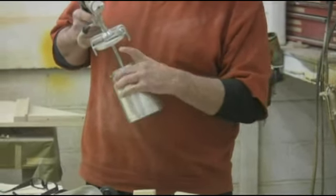I've got a quarter inch peg going into a quarter inch hole. So what you want to do is take that peg and, just below where you're going to go in, either sand it or whittle a little round spot. This ain't whittling too good. My knife's pretty dull, but you get the point. Drive your peg.